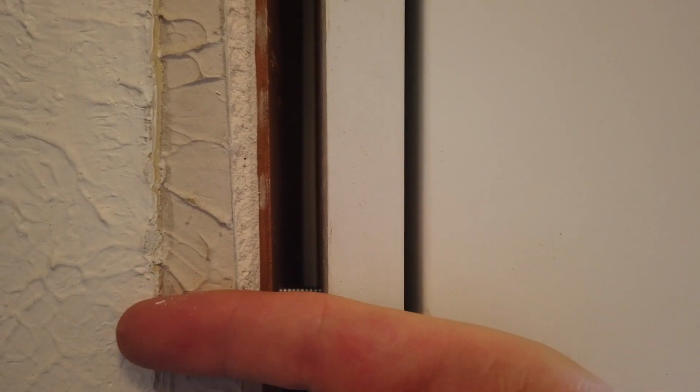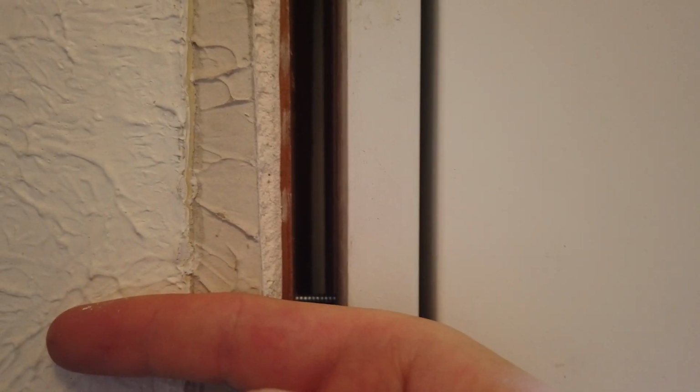So another thing I'll point out, I don't know if it'll show up very well. You can see there's that 3-inch screw, so it's enough to go through the door frame and then into this jack stud, and maybe even a little bit into the king stud. So again, we use 3-inch stainless self-tapping screws standard on all of our door installs.